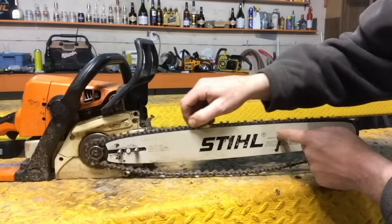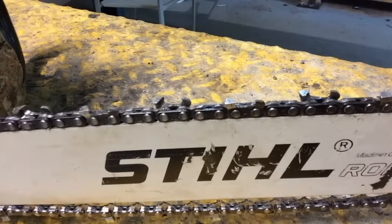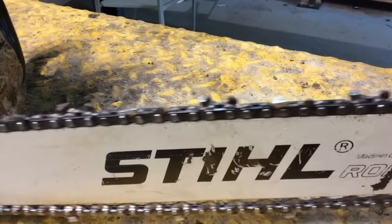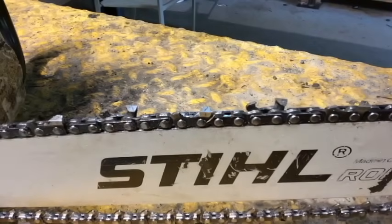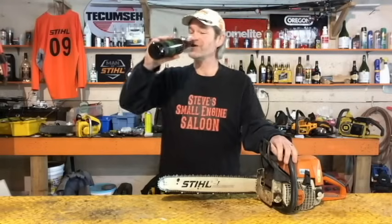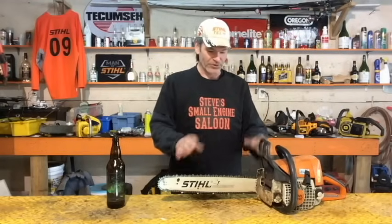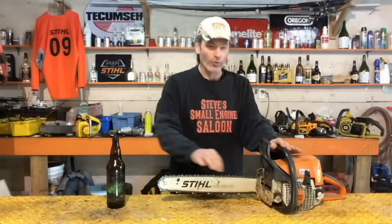You'll see — are the sharp parts of your chain moving forward? That's proper. If you put your chain on backwards it's going to look like this, and now you move it clockwise and you can see that it's cutting on the back side of the teeth. By the way, I didn't mean to make that guy look stupid in front of his wife — yes I did. So it's as simple as that: put your chain on, spin it clockwise so the pointy part of the tooth is going forward on the top of the bar.